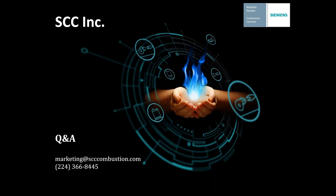The last question: are there other communication protocols available besides Modbus on the LMV? The protocol coming off of the Siemens products is always going to be Modbus. There is an eBus option, which is rarely used, so Modbus is far and away the most common. There are many applications that use TCP/IP, Ethernet, LonWorks, and BACnet — all of those have to be done through protocol converters. Once you fetch the Modbus data, you take it to a protocol converter and then you can go to all these other systems. Protocol converters are available through SCC for screens and any other application.